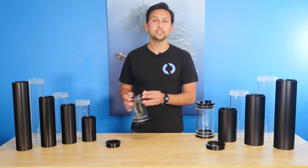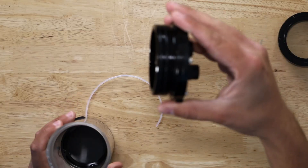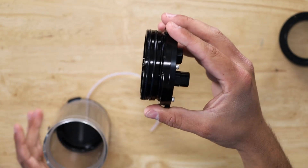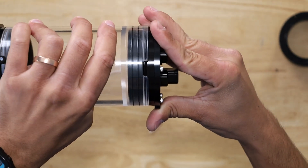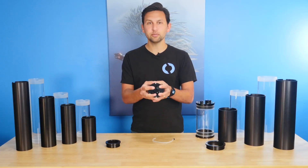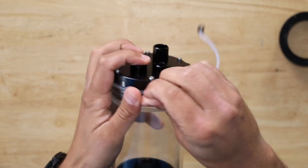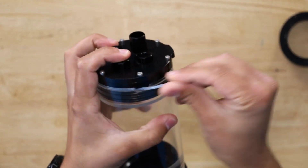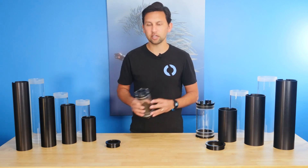Like the original enclosures, the end of the tube is sealed by an O-ring flange and end cap. The O-ring flange is updated with a key that interfaces with a notch on the tube to prevent the flange from being rotated relative to the tube. Once inserted, the tube and flange form a round groove in which a locking cord can be inserted. The locking cord comes with a little handle to make it easy to remove, or you can cut it off if you want the enclosure to be more permanently closed, like on a finished product.